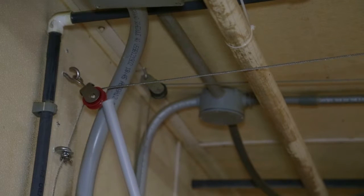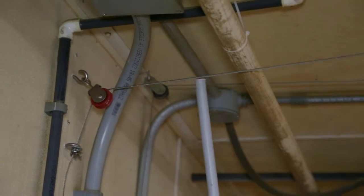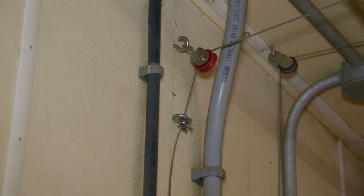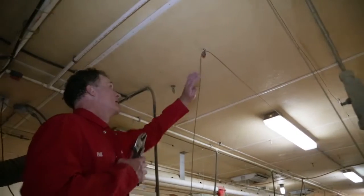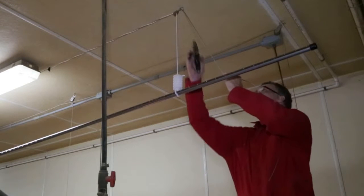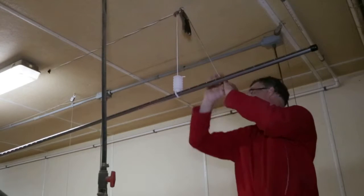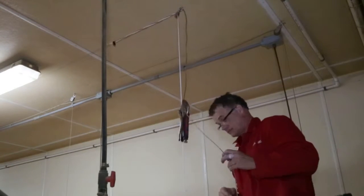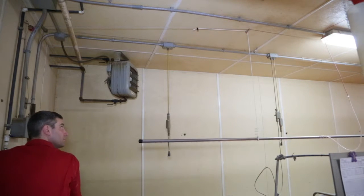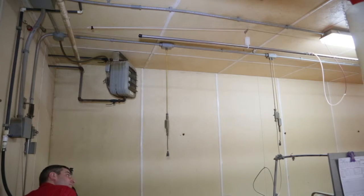There must be enough distance between the handle and the pulley to allow for maximum travel of the corona pipe runs. The winch must be able to pull the corona pipe runs all the way up. Pull the cable through the eyes of the pulley supports. Tie or clamp the end of the cable to the last or furthest corona pipe support, or attach a dead weight to remove cable sag. Allow 5 extra feet of cable. Do not allow the cable to rub on other objects. Allow enough cable movement for the corona pipe runs to travel the maximum up and down.